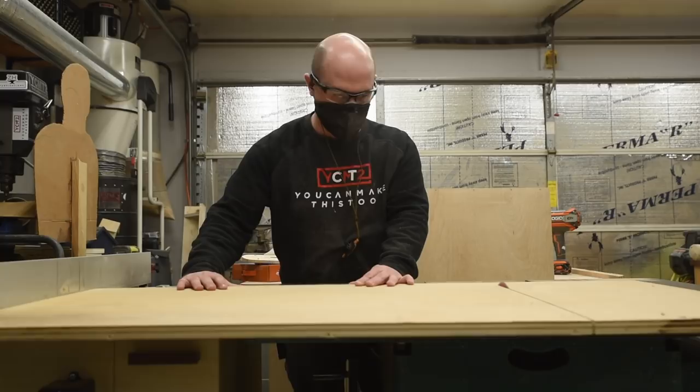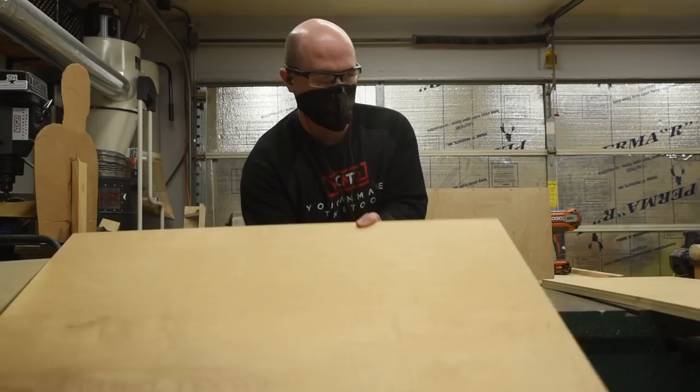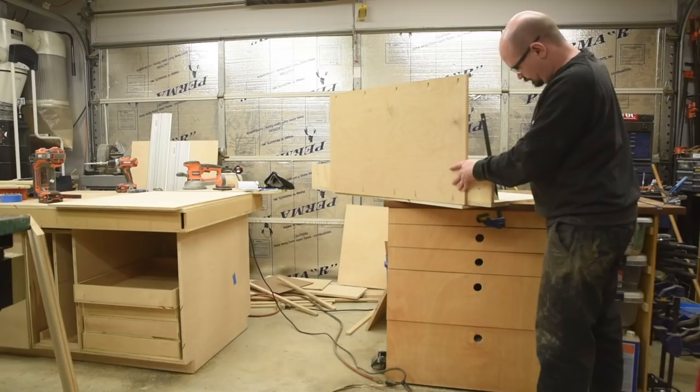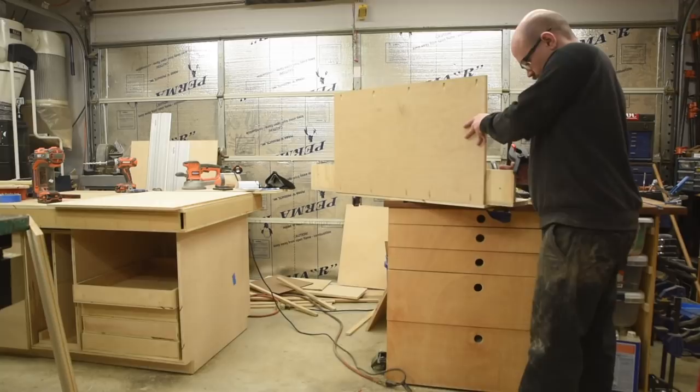I started by cutting the plywood down to the same length. This is going to be a really simple build — it's basically just an open-ended box with some bracing material inside. After I get everything cut down, I drill in some pocket holes to hold the whole thing together. It's a bit of a trick to hold sheet goods of any size in place while trying to pocket screw them together, so I recently made this right angle fence thing to aid in that process. It's basically a giant clamping square, so I clamp my pieces to it and then screw them together.